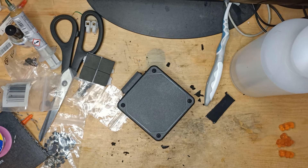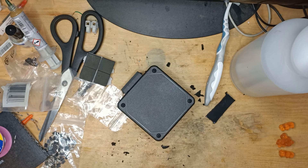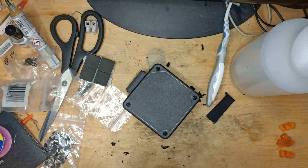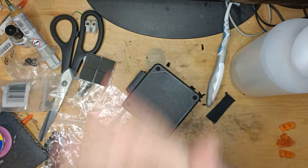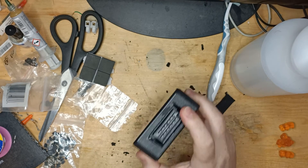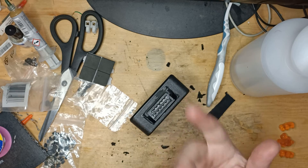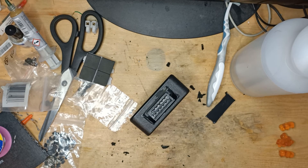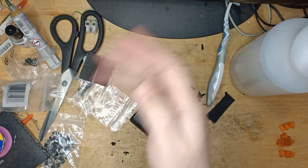You don't really need to test the steering wheel controls. The communication back and forth between the steering wheel and the BlueSaab module is entirely digital over the CAN bus. If the device registers itself on the bus as being a CD changer, then it's going to work — the steering wheel controls will work because it's the same communication channels. The audio lines are separate and they are analogue, so you do need to test those. Crank the volume up to full on the device, then pull that little tab and go left and right just to make sure you're getting both left and right channels.